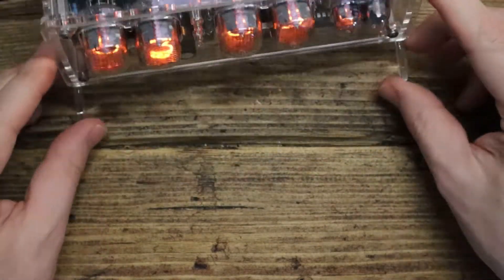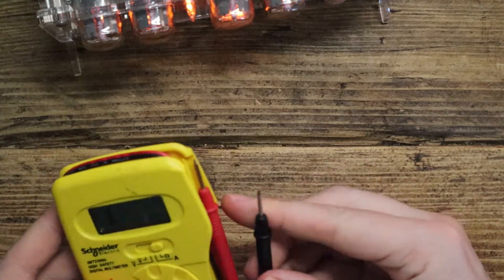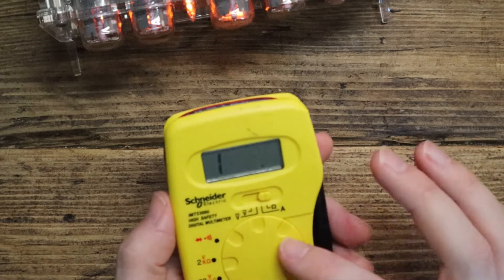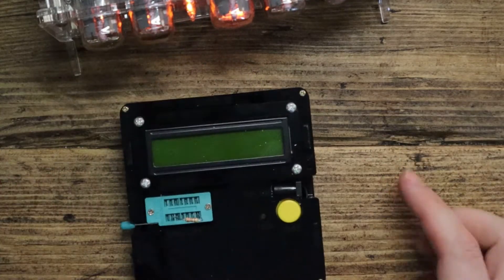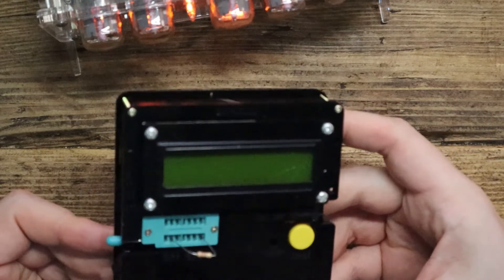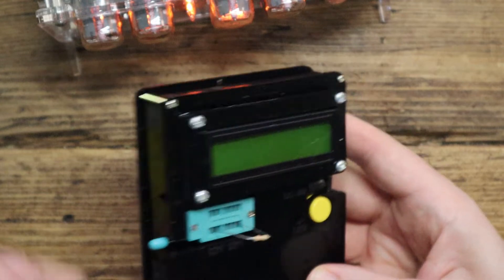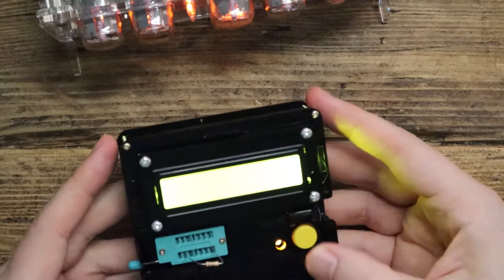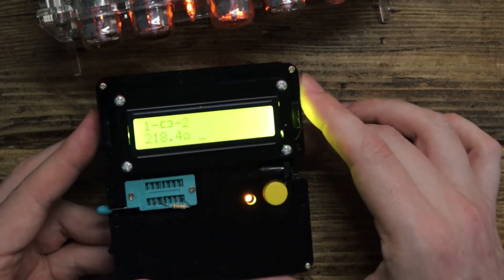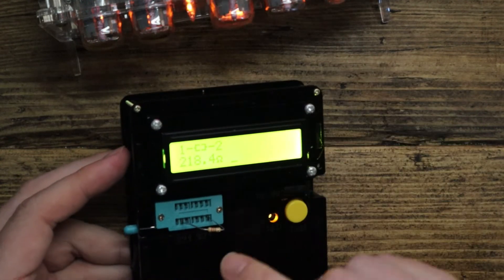To make sure you use the right resistor you need to either interpret the incredibly small colour banding, or measure resistance with a multimeter. I've generally used one of those, but the display is very small and you can misread it. So what I've used instead is this resistor tester — which was itself a kit I built. You drop a resistor into these little holes, turn it on, and it tells me that one is 218 ohms, so it's probably a 220.